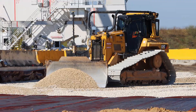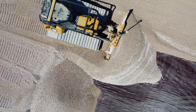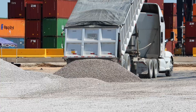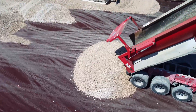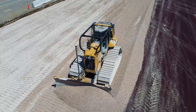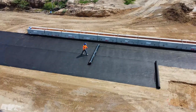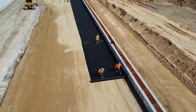When trapped, water travels best in coarse material that has significant pore space. This means rock would be the most suitable material to accompany groundwater in its movement, so we need to place a layer of rock on our stabilized treated soil. Typically, rock with an aggregate size of ½ inch is used. However, if we were to just place coarse rock over fine lime cement treated subgrade, fine particles that water would carry during its passage would clog all pores between rocks and water would be stuck. To avoid that, we need to add a membrane on top of the fine lime cement treated subgrade — this membrane is called geotextile fabric. The main purpose of geotextile is to separate the drainage layer from underlying soil, preventing any contamination of the ballast rock by soil.